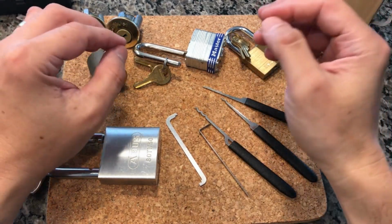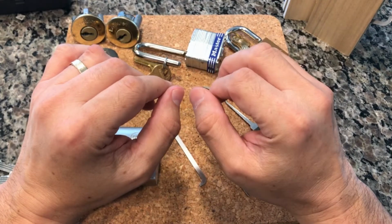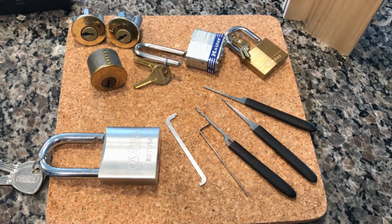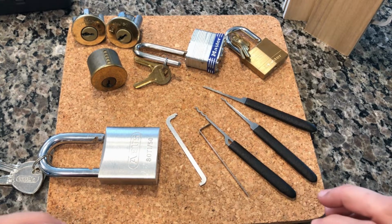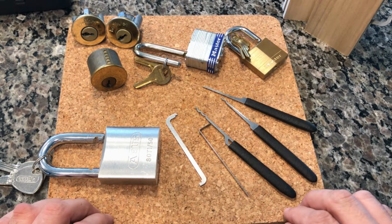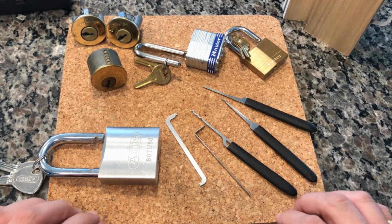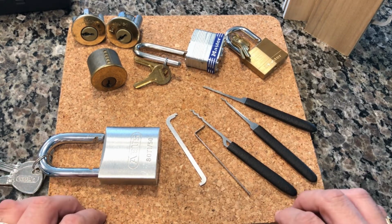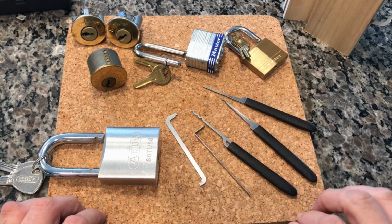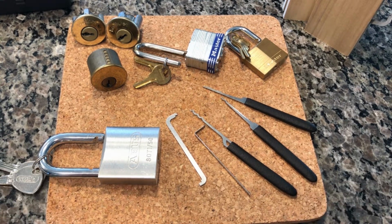Many locks, the more sophisticated locks, when you get to Medeco, where you have to rotate the pins and so on, are much less vulnerable to raking. When you start adding security pins with spools, when you start adding serrated pins, those things are going to make it harder to rake. So you're going to have to learn single pin at some point. And if you wait until you find that lock that you can no longer rake your way into, you're probably already up to a green belt lock, and starting to single pin pick on a green belt lock, when that's your first experience with it, is going to be a nightmare. So while you are still in the lower belts, that's your time to start working with single pin picking, when the lock's going to talk back to you and you get very clear language back.